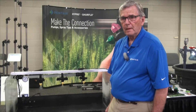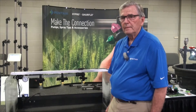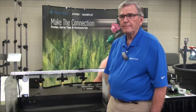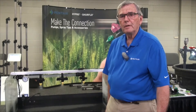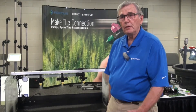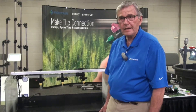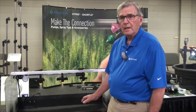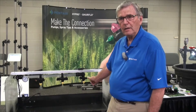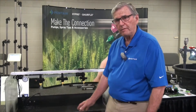These are dual nozzles, so there are two on each nozzle body. One of the things that comes to mind right away is the farmer would like to first trim the field where he has a boundary area to control the spray — it could be a neighbor's property, or his own canola which would be sensitive to what he's spraying next to that field. In that case, he would use a coarse-only spray setting triggered from the cab, which automatically kicks on and sprays. Then he combines that with the second nozzle for all of the inner part of the field.